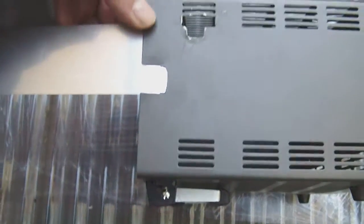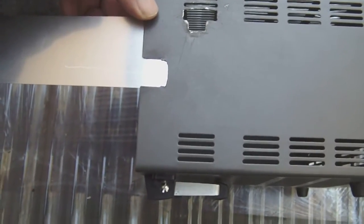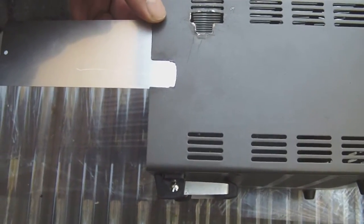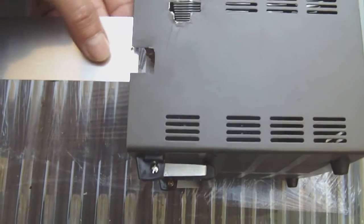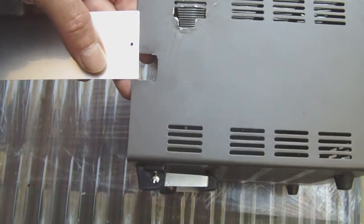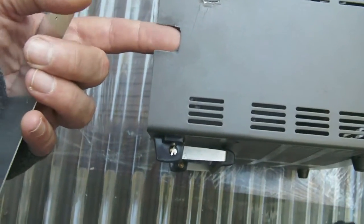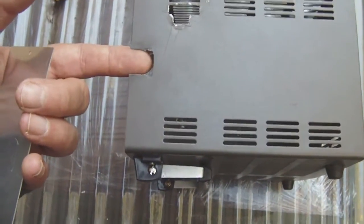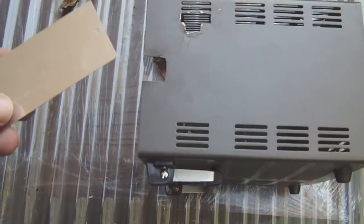And then I'm going to draw the exact shape on the aluminum like this, and then cut the aluminum. And when I have the piece of aluminum in the exact same shape as the hole it needs to plug, then I'll apply a tiny little drop of super glue around its edge and fit it exactly inside the hole which it needs to plug. When that is done, I'll see if I'll repaint it or not. Maybe I won't, maybe I will.